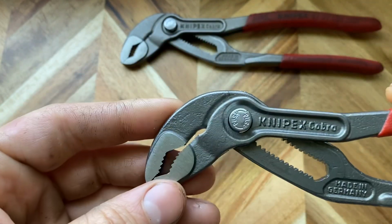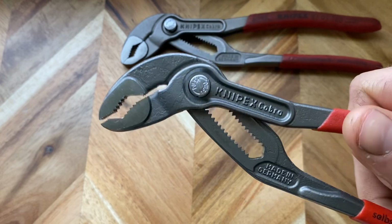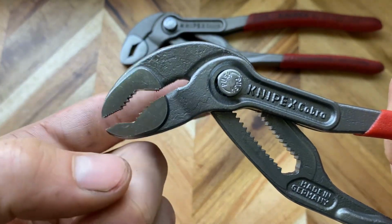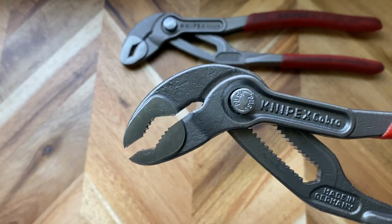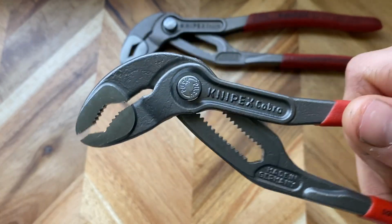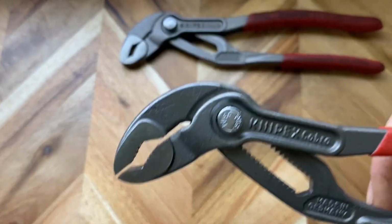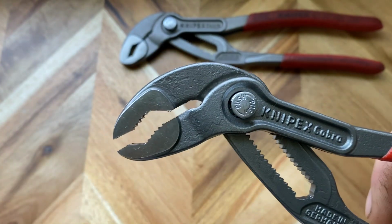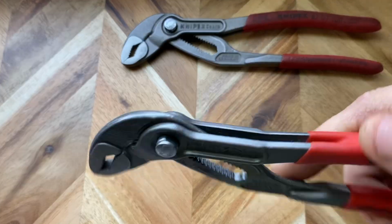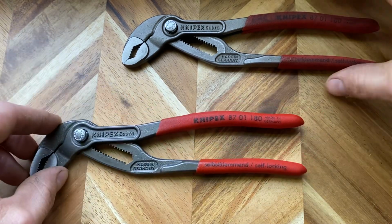And yeah, sometimes on acetylene torches, they have a square stem, and a lot of times the knob will come off. I grab that with these because of how small it is. I don't want to strip it out or anything like that. So I'll get it back in here, and these pretty much go parallel on it, and I can turn it, get it on.